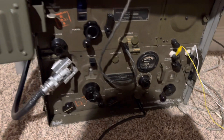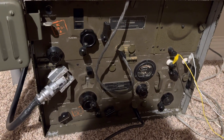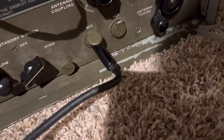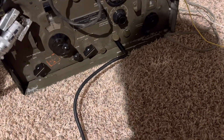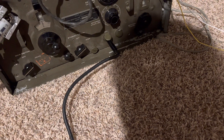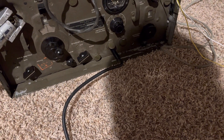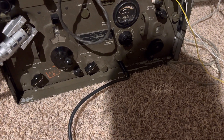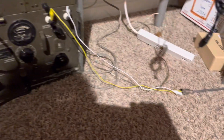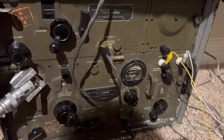Here's the World War II radio, the Crosley BC-654A. I had to take it out of the case a few times to fix the microphone connector, which I had bent up by putting in the wrong microphone pin. I tried putting in a later style — probably a Collins pin or something — and it didn't help the connector, so I had to take it apart and re-bend the microphone connections on the connector. Now we have transmit.